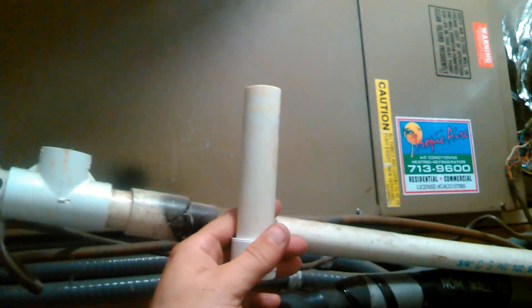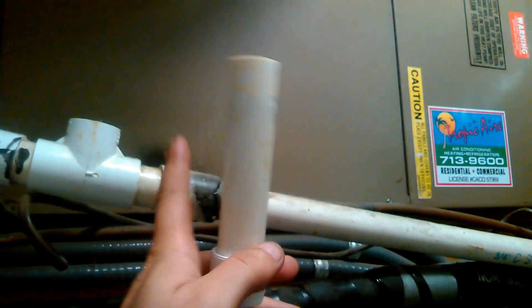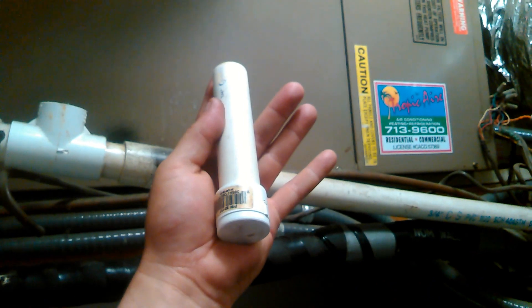Air conditioning is in here as well, and conduit goes to various places — they kind of just put them in the wall, it's a bit ghetto, but it's a utility room. I had to put a tee on here and made it long enough so while I'm doing laundry I can access it. Here's a tip: instead of calling the AC company out to blow out your condensate drain line with CO2 or nitrogen, take a piece of PVC about as long as your hand, pour bleach inside it, pour it into the drain line opening, and put the cap on. Do that once a month and you probably won't have any clogs.